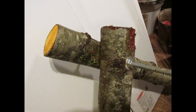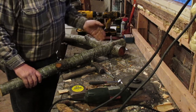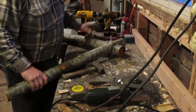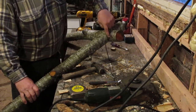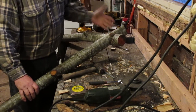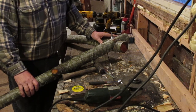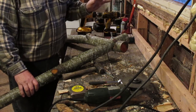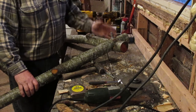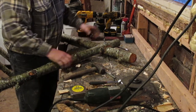On the bright side, a basic lap joint doesn't take hardly any tools. Next is the simple lap joint — it's just roughly notched so that the log will fit in there. It does have some racking but it runs into these notches, and it is a lot more stable than the last one. Just basic tools are needed: a bush saw, a knife, and something to hammer on the knife with. You can secure it with cordage, a bolt, a nail, root cordage or bark cordage — whatever you are using. And this will be a little more stable, a little more permanent.